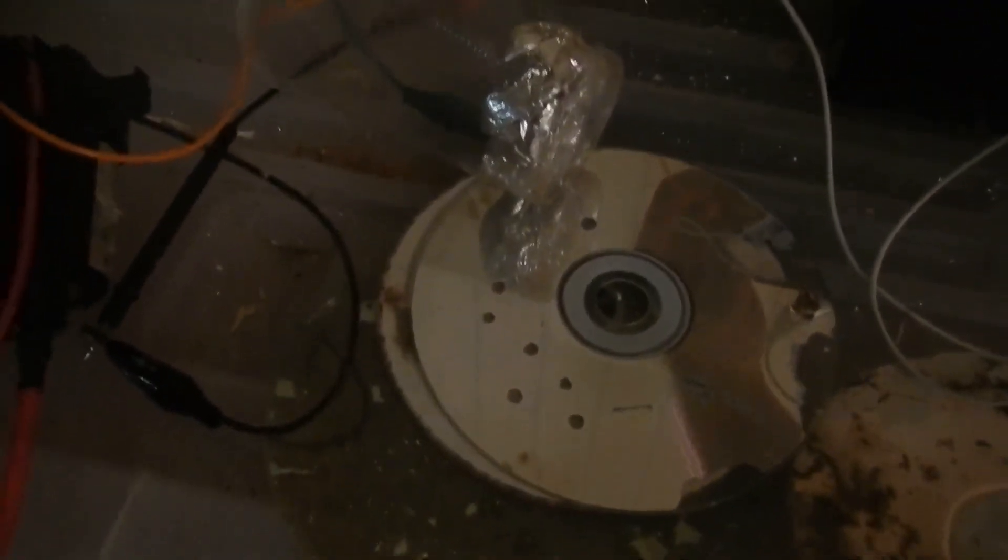So let's fire up. I've got a bit of foil in the bottom of the cup hooked up to my return on my flyback transformer here, which is currently being powered by a parallel 3055 for anyone that's interested in the electrical stuff, and let's see if we can find that leak.